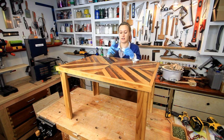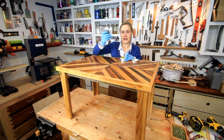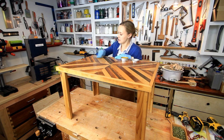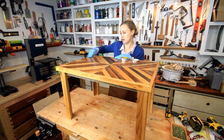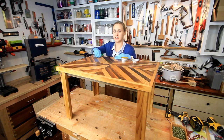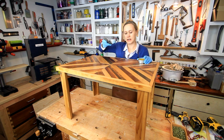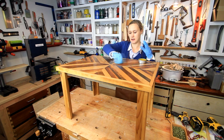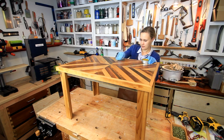I got my linseed oil wax polish and a piece of 4-0 steel wool. I just put on some of the wax mixture and start working the polishing. You don't need a whole lot and you don't need to work really hard — you just want to apply it everywhere. The reason I like to use steel wool for this step is because it really acts as a fine sander, making everything even smoother.